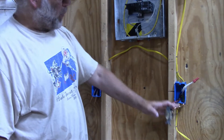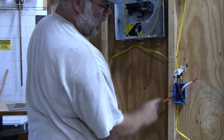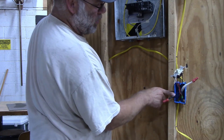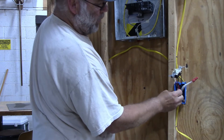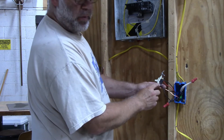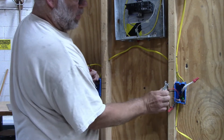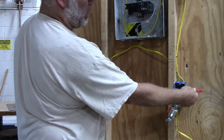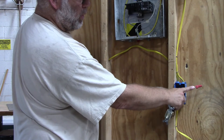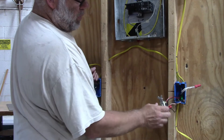On the other three-way switch with the power, I have power coming in. Down here I have one power wire, then I have one going off to an outlet, so I have a second power wire. Those two power wires need to be hooked together with a pigtail and then go to the black screw on the three-way switch. The traveler wires coming from the other box are across from each other. The neutral wires are again hooked together. If you have a neutral on your switch, you can run a pigtail off this neutral and run it to your switch if you have one of the new neutral switches.